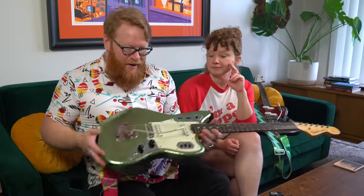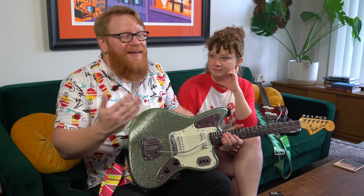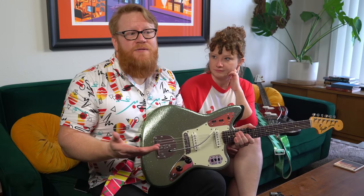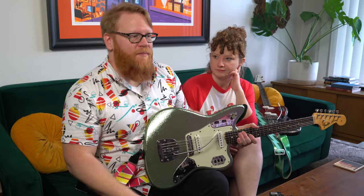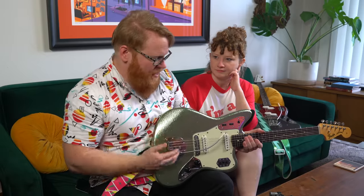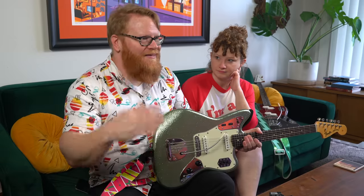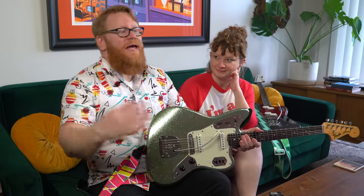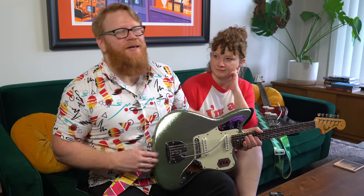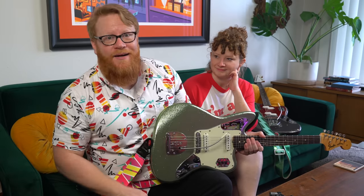Yeah, so I always get questions about what pots people should use in their Jazzmaster or Jaguar, and I always stick with one meg. Every time I've tried to step down to 500 or 250, it sounds fine, but it loses something for me. And I understand that that makes them very bright. That's part of the sound for me. I use very dark amps, so I'm hitting a very dark, loud amp with a bright guitar, and I don't know, that's what works for me. May not work for you. If you use like a silver panel Fender or something else that is extraordinarily bright, you might enjoy stepping down your pots from one meg, but me, I'll stick with stock.